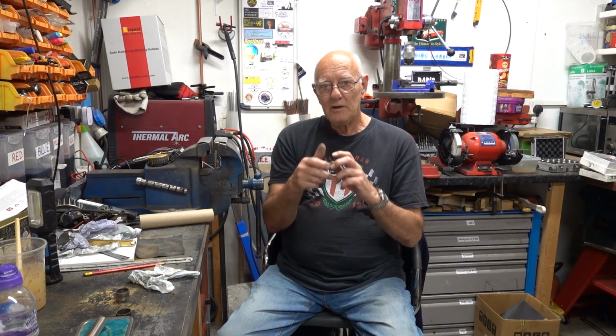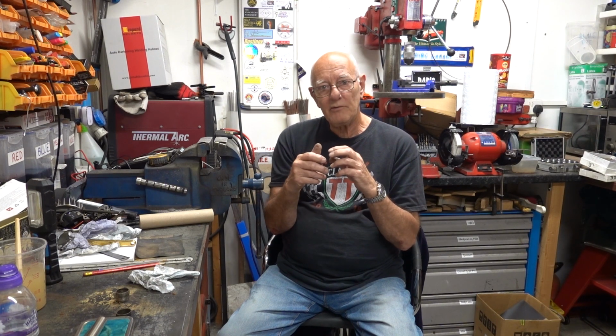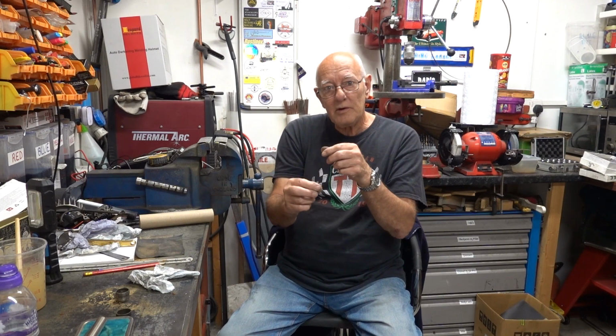The only one that was, was the one that I showed you in palm wood, but that's a bought ring blank that screws apart, and you cut your blank out of your piece of palm wood with hole saws, and then you slide it over and bond it on, and then you screw the end cap on, so you've got the complete ring. That's a bit cheaty, isn't it, really? The ones I'm talking about doing with little strips of wood, you actually make your ring on the lathe and then put your wood round it.